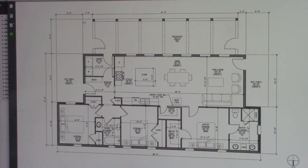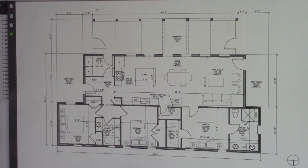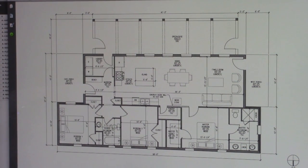Obviously, if you live in South America, you'd be orienting the house in the other direction. North would be up this way instead of down this way in this particular drawing. And I actually looked down at my calculations. I did bring the AC space in, so this house is actually 1,407 square feet, not 1,440. 1,440 is through the exterior.